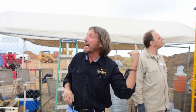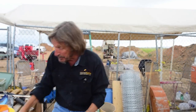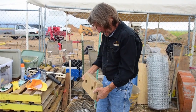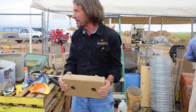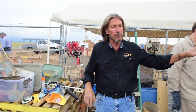The visual part of this roof matters — we're building a structural roof but it's also a visual piece of art from inside. We want the joints to be straight and our offsets to be good. When you look at each block, identify which face looks best, and put that face down on the form, because that's the side that will be seen at the end of the project.